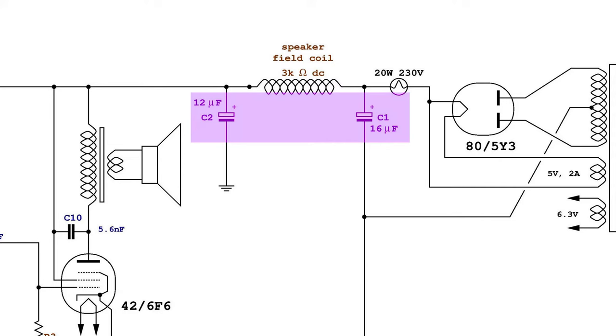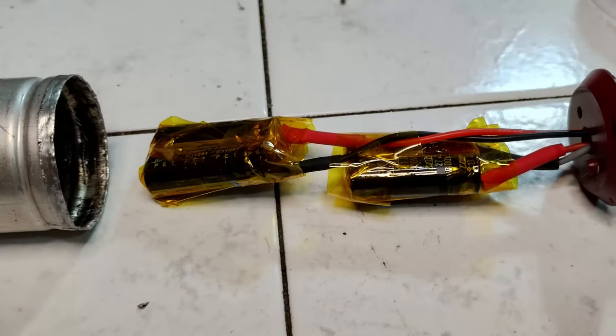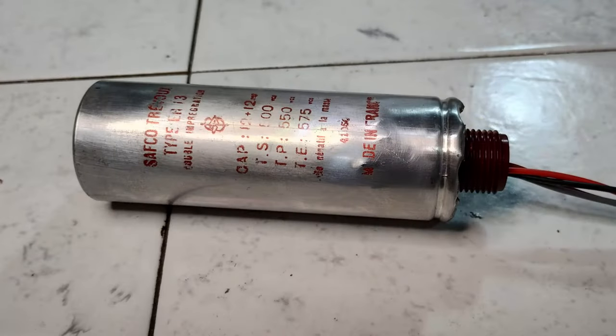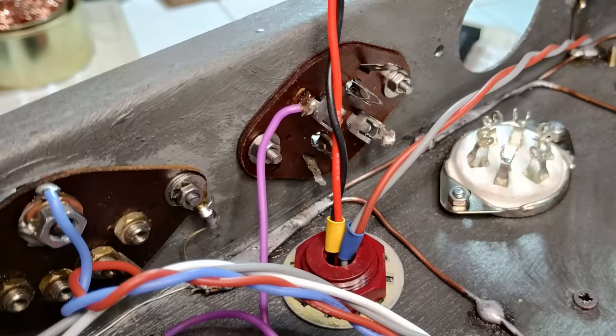This time, the old filter capacitor can that was dripping some liquid is cleaned from its guts and then refilled, using the capacitors in series already installed previously. With current arrangement, the negative side of the first capacitor would not be connected to the chassis. Therefore, it is important to keep the 2 negative leads separated and distinguishable, also using wires with different colors.